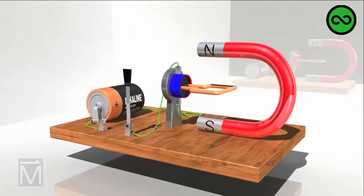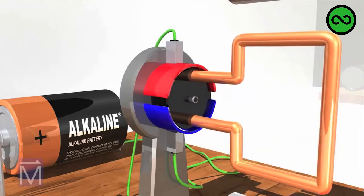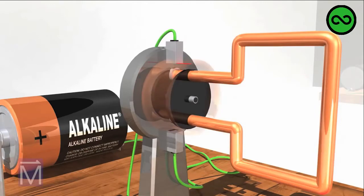Let's talk about how the design of a DC motor leverages these two forces into a machine that can do endless types of work. The current that runs into the armature passes first through one of these graphite brushes, then through one of the two semi-circles that make up what is called a commutator — a rotary electrical switch made of copper and featuring two gaps. The cleverly designed commutator is key to making the DC motor work.